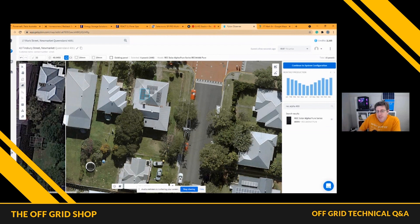In your situation, if you think about it like this: you've got panels in the east here, so in winter the sun's going to rise over here and set over there. These east-facing panels are going to do their best performance in summer; the other ones do best in winter. They're really just going to crank and then the sun comes around — same thing in the afternoon. You can see all the different productions here: 33 kilowatt hours per day in the middle of January, and in the middle of June, 18.6. Now if we actually spin all these panels around and face them north — we have one east, one north roof — still 33 kilowatt hours a day in summer and 20 kilowatt hours a day in winter, so a little bit more production in winter.